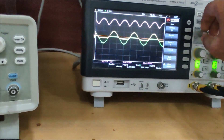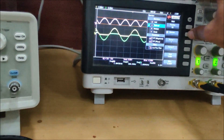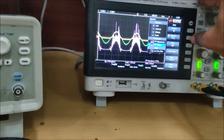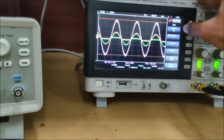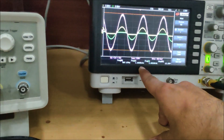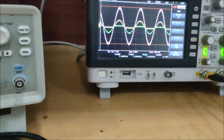Adjusting it a little more clearly — you can see the rectified waveform. If we add both waveforms together, we get back a sine wave. The frequency of channel one is 1 kilohertz as set, and channel two is also 1 kilohertz.